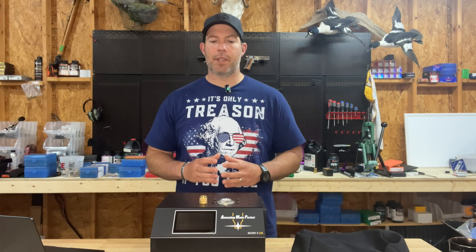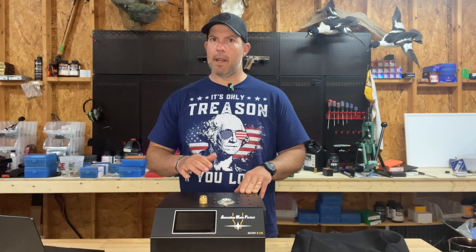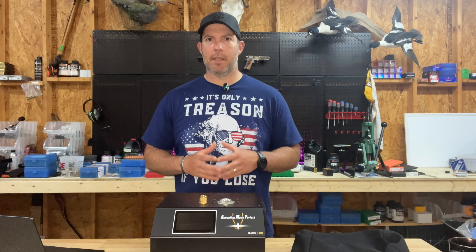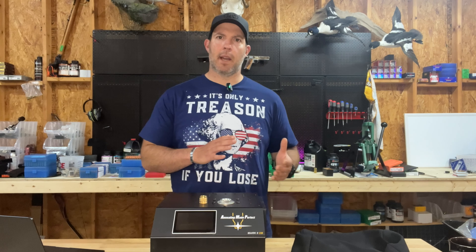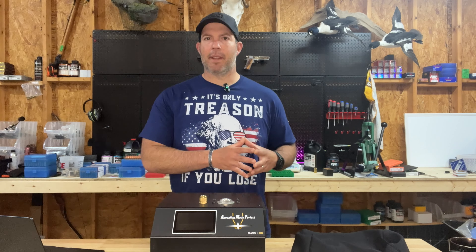The good thing about that is nothing in the machine is actually getting hot — just the brass case itself is getting hot. And the other good thing is this allows you to basically quickly superheat the neck and the shoulder of the case without doing the rest of the case. You might ask, why couldn't I just put these in the oven or what's wrong with flame annealers? Well, the longer you take to heat the case neck, the more of that heat will be transferred down to the bottom and the base of the case. That part of the case is not really getting worked over and over, and we don't want to anneal that to a softer level of hardness because you don't want the primer pocket to expand or things like that. So annealing the neck and shoulder without affecting the head of the case is very important.